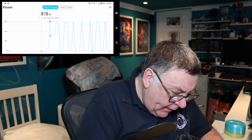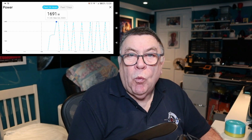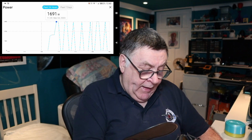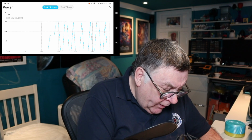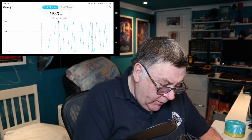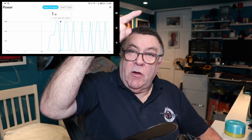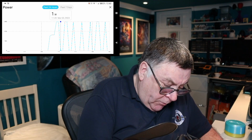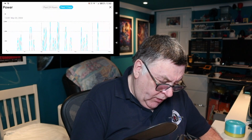And then if I click at the top there, you can see then at 11:35, it was using 1.69, so 1.7 kilowatts. So that's when I flicked both switches on. And you can see there it's using that for a little bit of time from 11:35 till 11:40, and then it shot right down to 1 watt because the thermostat shut off. It was off a bit, and then as you can see on the chart, it's on for a bit, down, off, on for a bit, down. So you can see there the thermostat kicking in. And again, we can go back to 7 days and see how much it's cost.